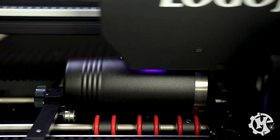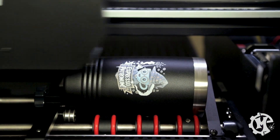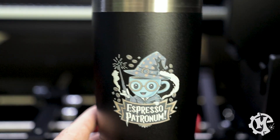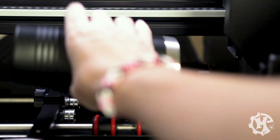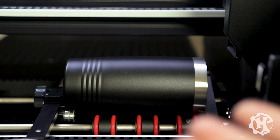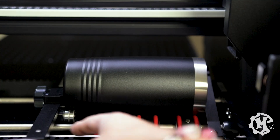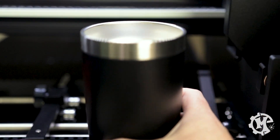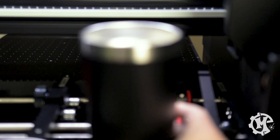Now for the real thing. I will say that before you print onto metal surfaces like this, make sure that you're using an adhesion promoter, preferably one that is meant for metal adhesion. The cool part is I can just put this cup down, take another one, place it right here, hit print, and it'll print out exactly the same way because I have the stop set up for the rim and the height. So if you're doing production runs of say 100 of these, having it dialed in makes it very repeatable for a production-level set.